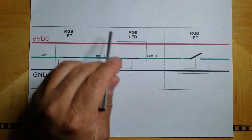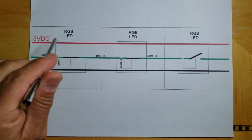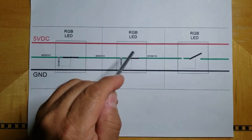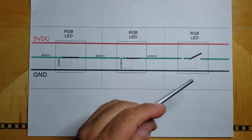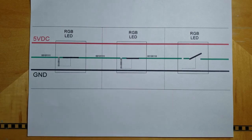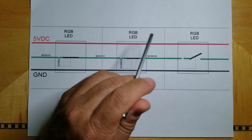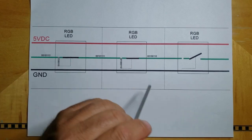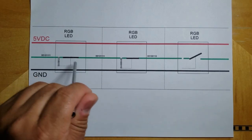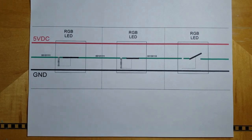So if you only wanted to light one LED, you have to plan accordingly, and you have to send null information to all the LEDs preceding that one. And you probably, in best practice, have to send null information to all the ones after it. I guess you could just insert a pause of 50 microseconds after this and start the process over. But I think it probably is best to write null information to any LED you don't want on, and just send the data you do want.